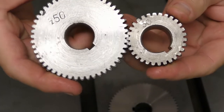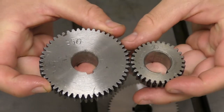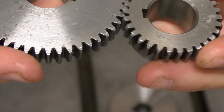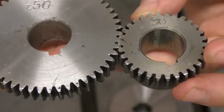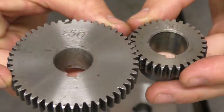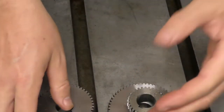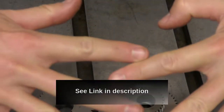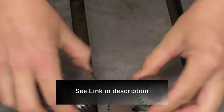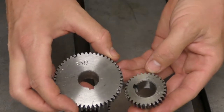This type of gear is called a spur gear. The way the tooth is shaped is mathematical - it's the relationship between how they mesh and roll together as they come together. The projected path of the meshing results in an envelope which gives you the shape of the tooth. Gears are supposed to roll together, not slide as the teeth come together - they're actually supposed to roll on each other as they come in and out.